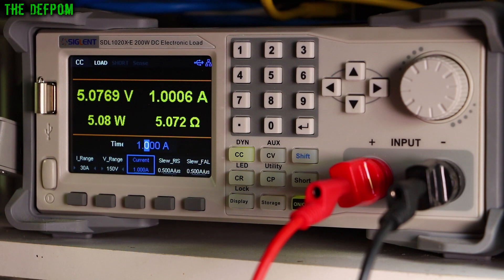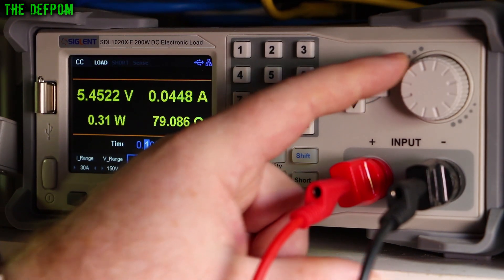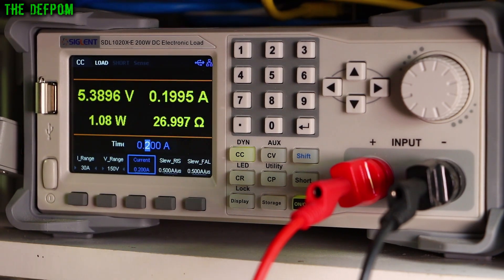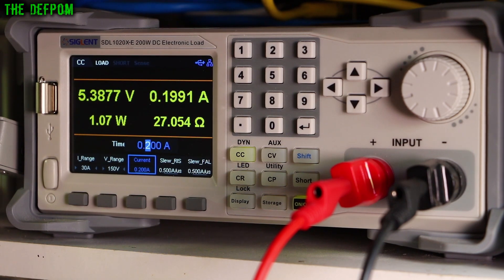Although it feels quite light. So if you've got 1 amp loading on it, you're going to be getting constantly 5 volts, which is pretty good. But I'm not sure about this whole maximum voltage being about 5.4 volts — it's getting towards 10% high with no loading. I did a quick Google search and the voltage specs are variable depending on the era. It used to be 5.25 volts max until about 2014. After 2014, 5.5 volts is the maximum rating. So 5.4V is within the current spec, I suppose — that's a good one. The power supply doesn't weigh much but it seemed to be okay, although I haven't checked noise.